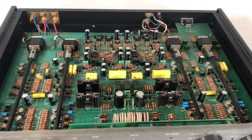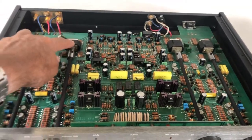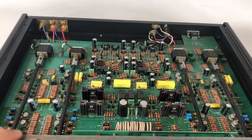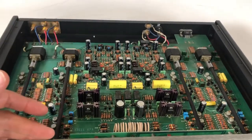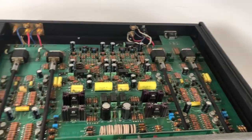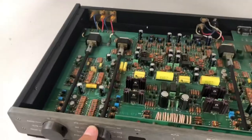Let's take a look at the internals. First thing you'll notice is that they use these connecting rods in order to place the potentiometers in the absolute best place possible. So rather than having to compromise and move them to the front of the board, they wanted them to be as close to the inputs and outputs as possible. They run these long shafts connected to the potentiometer knob.